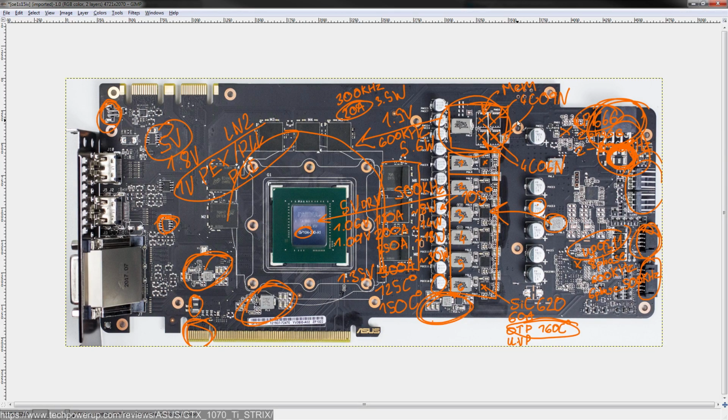Well, if you go far down enough in the price, into the low end GPU category, you start seeing Strix cards where you can't say, okay, well, I don't know. I don't feel like I've seen a Strix card where I'd say the VRM is outright terrible. I've seen some where I would say the VRM is not good, but this one's definitely one of the good ones. You know, it's a strong 6-phase, and a 1070 Ti really doesn't need more. Even on liquid nitrogen, it doesn't need more.